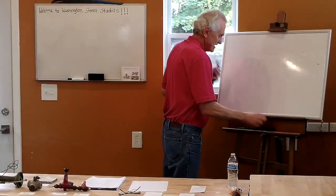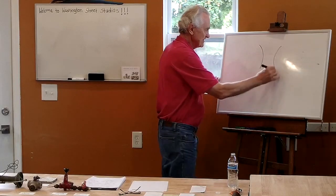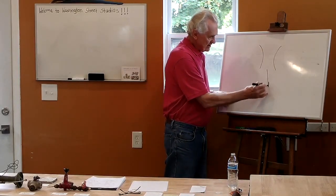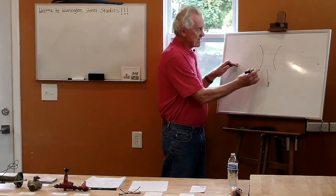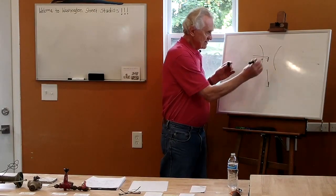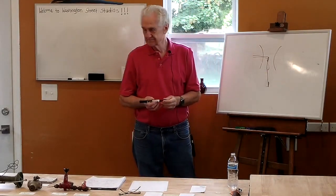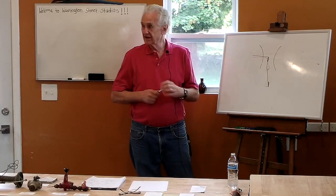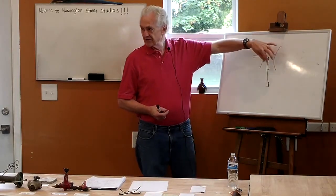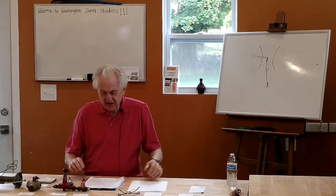Only in a carburetor, you had a throat like this, sitting on the top of the engine, and when you drew in air through here, you had a little nozzle coming in like this that drew in the fuel. So this created suction and pulled the fuel in. It was the same idea: you suck in air and bring it through this constriction, which creates a local vacuum and draws in the fuel. Okay, burner sizes.